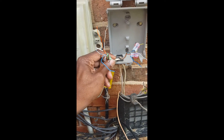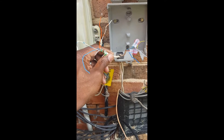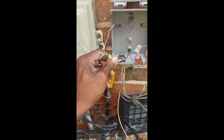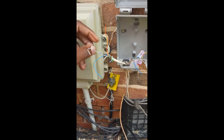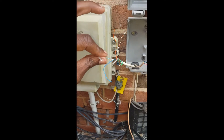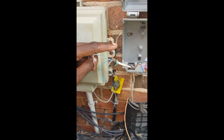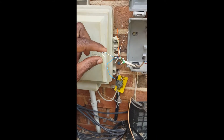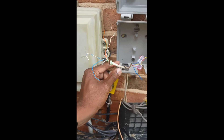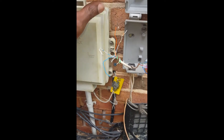I do know that this is my modem wire — this is the Cat5 line that goes to the modem. So this goes to the MTA; this is bringing my dial tone out to the NID. The dial tone is only going to be on the blue and the white-and-blue inside at the jack at the MTA. The white-and-orange and white is not even hooked up.